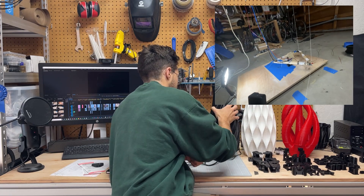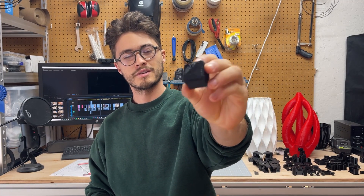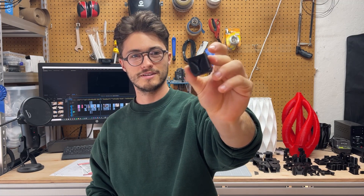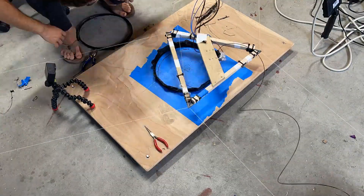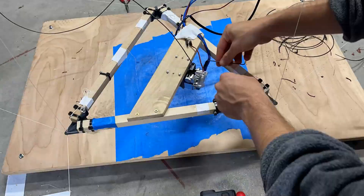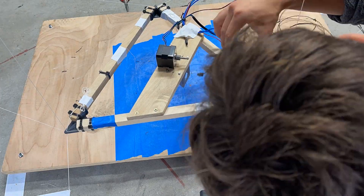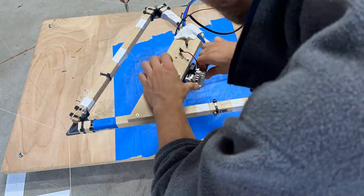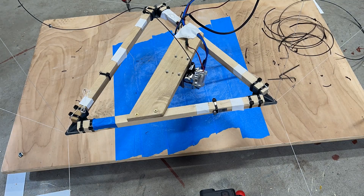It was an actual cube — I think I have it right here. The first layer kind of messed up, but in terms of the walls and the shape it was pretty good. Better than last time. I was starting to get confident with this printer and so I tried a 14-inch diameter vase, which started to show some signs of skipping. So I went with a smaller vase and that came out much better, but at the end the nozzle got clogged and I had to take it apart and unclog it. I did some research and it looks like I was pushing too much plastic through the extruder, so I backed it off for the next few prints and it turned out to be a lot better.